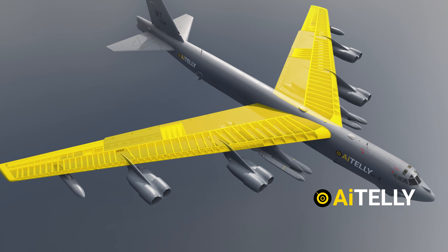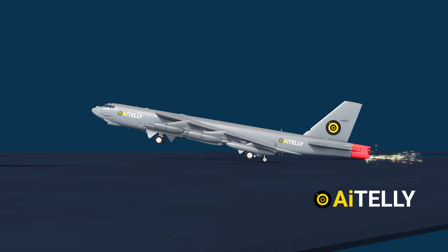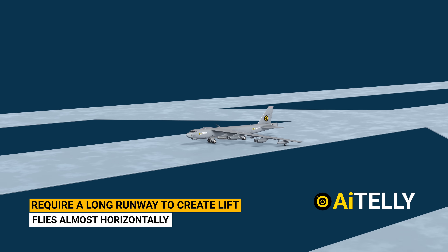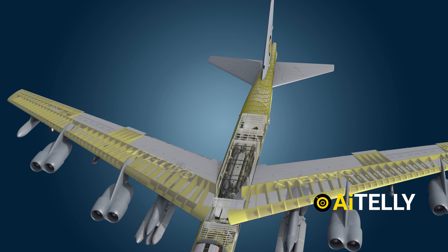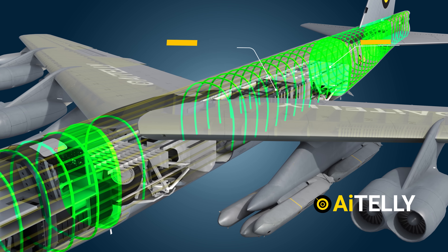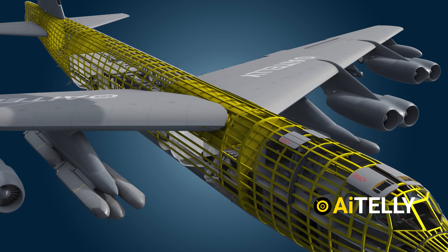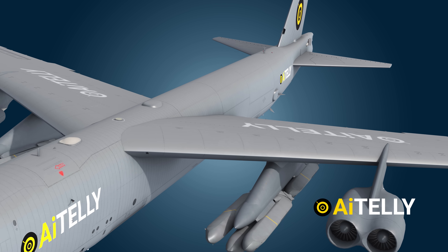A quick note: because its wings are so long and flexible, the wings and tail would touch the ground if the nose were raised too much. This is the reason they do not rotate like a regular aircraft while taking off, but require a long runway to create lift and fly almost horizontally. Moving back to the frame, this wing structure is directly connected to bulkheads and horizontal formers all over the plane, which are made of high-grade steel and magnesium alloys. Hundreds of panels are riveted to these frames to give it a lightweight, versatile, aerodynamic structure.